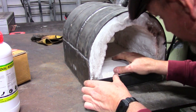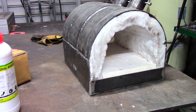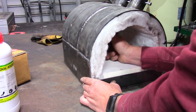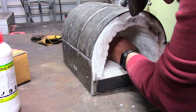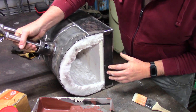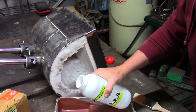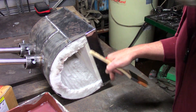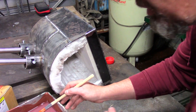I don't like that there's a gap between these two bricks. I think it's because the wool is caught between them. Let me see if I can get something in there and clean that out. There it is — it's on this side. That looks good. I've turned my little forge over on its side to keep from getting rigidizer on my refractory brick — not because I'm worried about it doing anything to the brick, it's just that it won't do anything for it, so why bother?